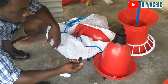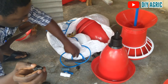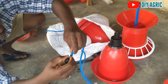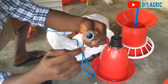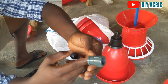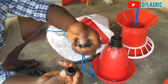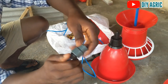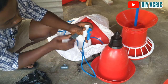This also comes with your drinker. This is the other end that will be connected to the hose — this one will go inside the hose just like this, you push it down. Before you do that, you also get this kind of fitting — I don't know the name for it. It has threading inside and it's also for half-inch. It's a socket but it also has threading on the other end. That threading holds this guy here, and this has a rubber washer, so you need to make sure it's sealed.